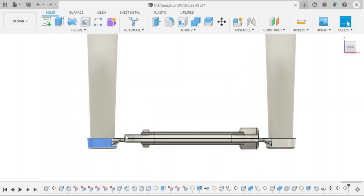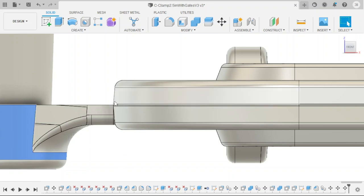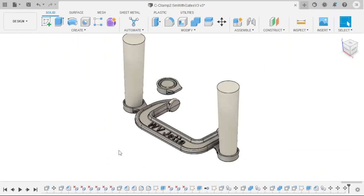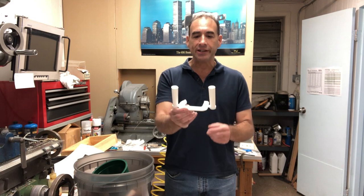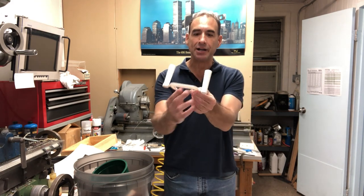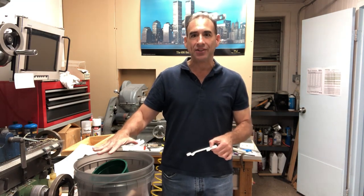Another thing is the good use of draft angles. If I zoom in on different parts of the mold, you can see that I maintained angles so there are no fully vertical faces. This allows the pattern to be removed from the sand easily. At this point we have our pattern 3D printed, consisting of the top and the bottom and the sprue and riser cones. We'll first put this in the drag and start packing our casting sand around it.